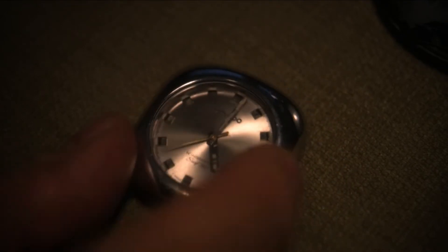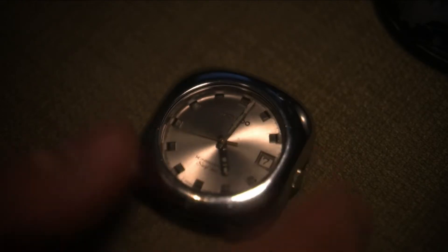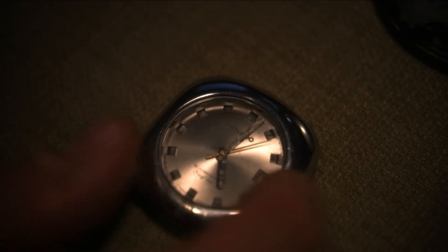It's got the sapphire crystal and the face is in really nice condition, as you can see. Those are the original hands, original case, original sapphire crystal, original crown, and even the date wheel is original. I'll tell you why — I got a replacement movement and the date wheel was the wrong date wheel, so I had to pull the old date wheel off and glue it onto the new watch.